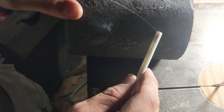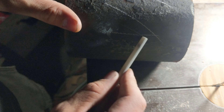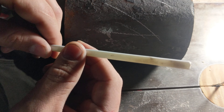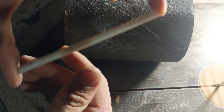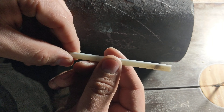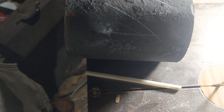Now, the best thing about soapstone is that when you mark something, even if this gets hot, the soapstone will stay on there because soapstone is resistant. It's very resistant to heat, which is great, especially if you're cutting something with a diamond blade or any abrasive blades, and you need that mark to stay on there so that you can see — consider a soapstone.